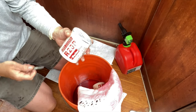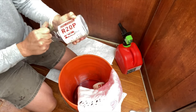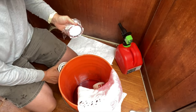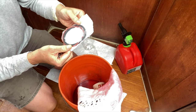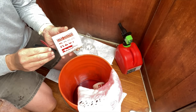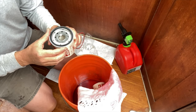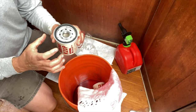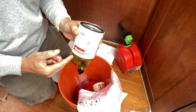Let's open up the new filter. There's one really important component in here: the O-ring set. The new filter comes with two O-rings — the red O-ring goes at the bottom, and the black O-ring goes at the top. It's important that these fit well because the system has to be airtight. If any air gets admitted into the system it won't work properly, so these O-rings are very important. I've reassembled the bottom of the assembly with the red O-ring in between.